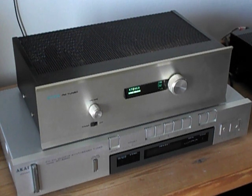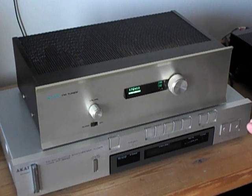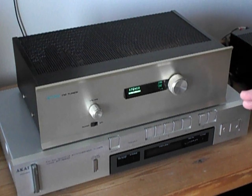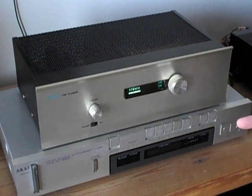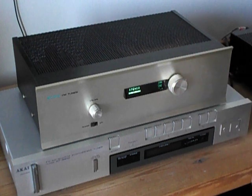Great stereo separation. And the funny thing about it is, it has all original Dynaco tubes, Dynaco label tubes. Cleaned up the boards. Once I got all the components in correctly, I went through to align it. Every single IF can was spot on. The tuning cap was spot on. The dial indicator was on. The multiplexer was on frequency. It just took a tiny bit of touching up.